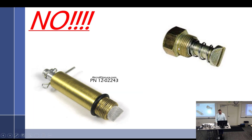Did I tell you about these? You just screw it right in there, and it just grabs hold of that little plastic tooth. No problems whatsoever, yes? Yeah. What's the problem? It breaks. You put any stress at all on that gear, and you will crack the gear tooth. And if that tooth cracks and breaks off, this quits. If this quits, that side quits.